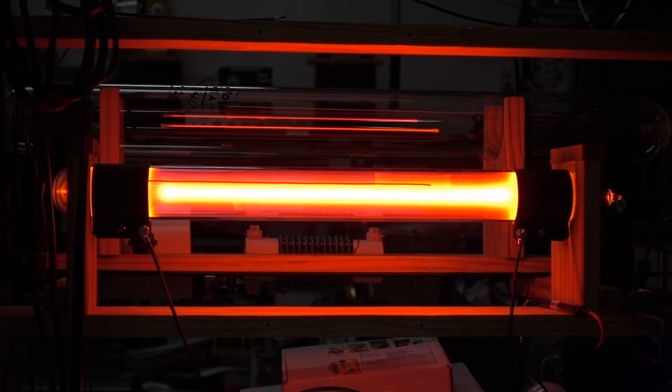We're going to raise the power to the tube to force the gas out faster. We're now running at 152 volts. Current of 1.35 amperes. Peak amplifier voltage is about 540 volts peak, which is normal for that operating sequence.